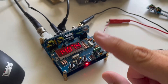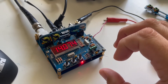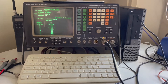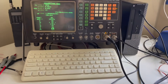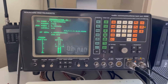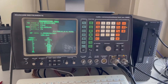So that is excellent. I expect this to get a little bit better when I replace the plain crystal with a temperature compensated oscillator. And in addition to that, when I get my Thunderbolt feeding into the Marconi as a frequency standard, the measurement side will get a lot better too. But right now I consider this to be a pretty tremendous success — a lot more so than I was expecting, seeing it off by just a couple of hertz. That's good enough for me.